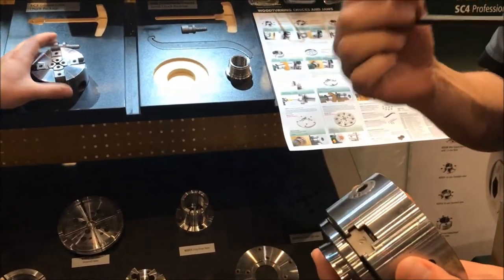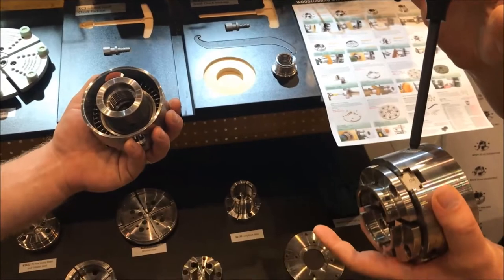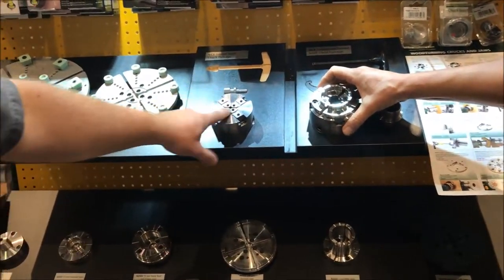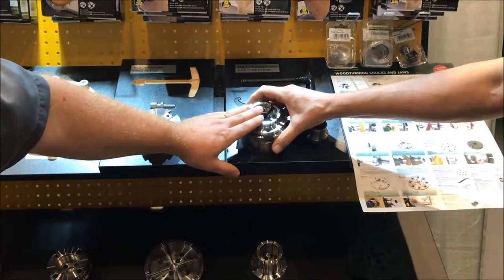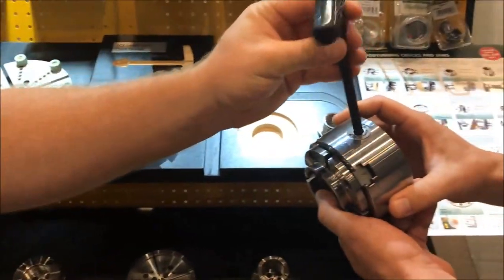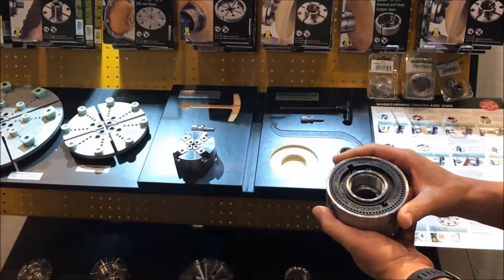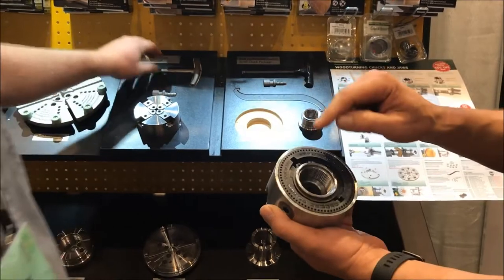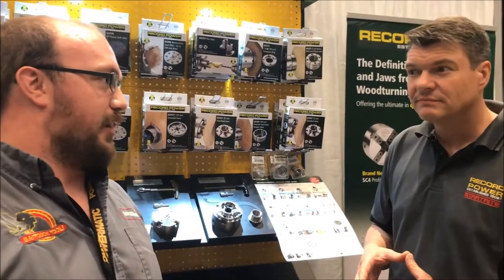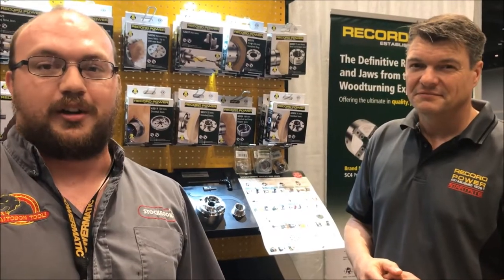Another very important factor with both of these is the scroll ring has been inserted in a very intuitive way — right to tighten, left to loosen — and you'd be surprised, not all chucks are made the same. So this one is lighter, a little less expensive, direct thread, and you can't change the thread on the back. This one is heavier, sealed back so less likely for debris to get inside, and with the ball-end hex key you have flexibility to tighten and release at an angle. You can also change the spindle thread if you have more than one lathe. Because there's a backing plate with 72 equally-spaced holes, you also get indexing. Thanks very much Mike — if anyone has questions, email us at info@stockandsupply.com or comment on the video. Thank you for watching!